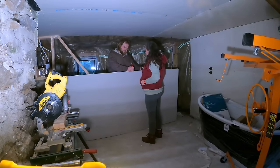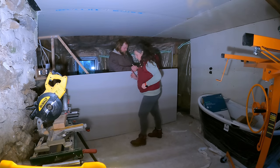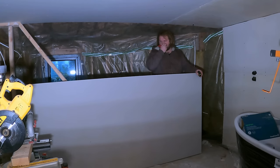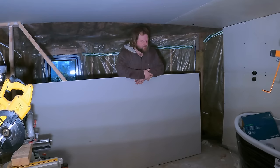This was really easy to do when we were doing the larch on the outside, but now we have to somehow bend the plasterboard into a circle. And I don't know where your knife is. But it's actually quite hard now because I've tried a couple of times. And if we bend it too much, it just cracks and then you have a big gap in the paper. So you just want to bend it ever so slightly. This is really very stressful, Claire.